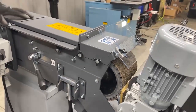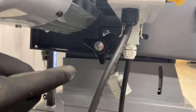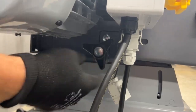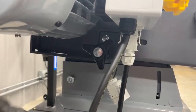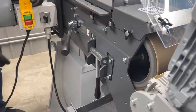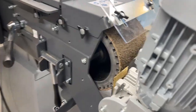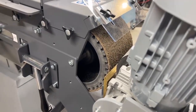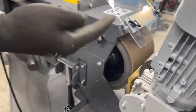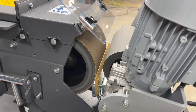Your tracking lever is this knob underneath the power switch. If you turn this knob in, it moves the belt in that direction — turn the knob out and the belt will come over on the contact wheel. We're going to do a real quick fire up, and it looks like our belt is tracking well. When I turn the machine on you'll see the action of the brake wheel countering the action of the contact wheel. Everything looks ready — we're ready to grind our first tube.